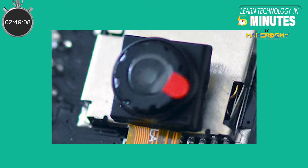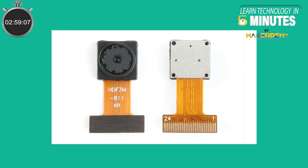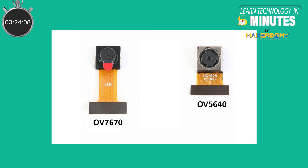Let's dive deeper into the key feature of the ESP32 Cam — the camera. Before we get into the software aspect of the camera-enabled features, let's look at the 2-megapixel camera that comes with the board. The camera sensor is called OV2640. The OV2640 is a popular camera chip and the first quarter-inch 2-megapixel camera sensor distributed across the world way back in 2003. This camera sensor chip is integrated with a compression engine suitable for small or large-scale projects like embedded systems, object detection, toys, facial recognition, etc. If you are thinking about upgrading your camera on the ESP32 Cam, the seamless options include OV5640 and OV7670, which are officially supported by the ESP32 Cam.